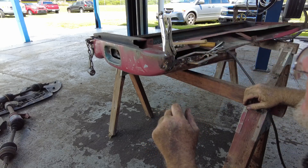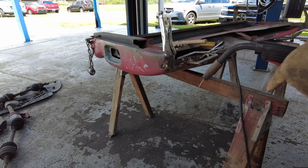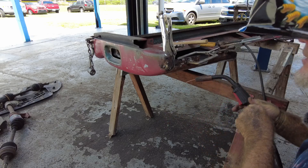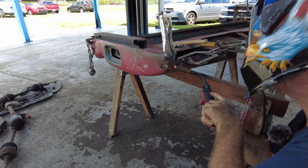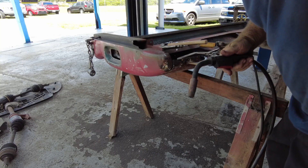I'm only fixing these little holes because I know they're there. Get the old welding helmet on so I don't get weld burn. Got to hook up your ground — one of the handy things about these pliers is they'll hold the metal and give you a good ground. I'm going to weld it on the inside too in case grinding it off makes it too weak.